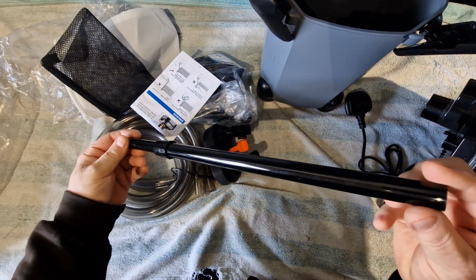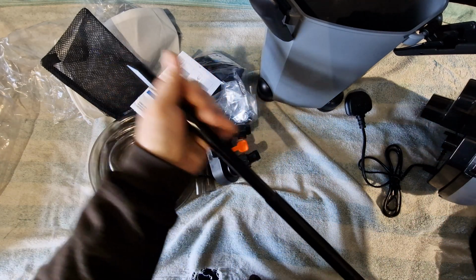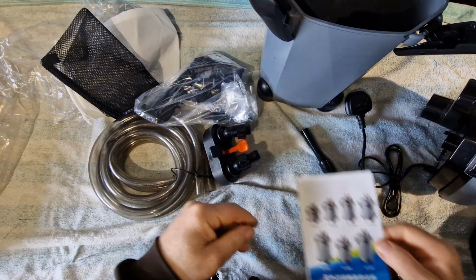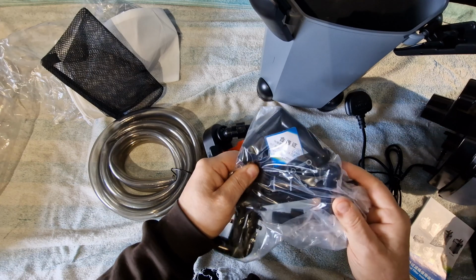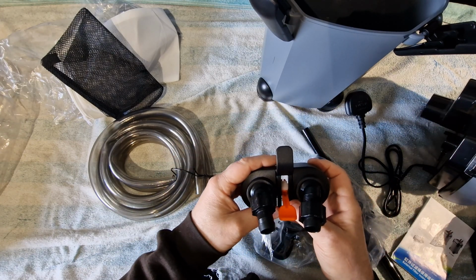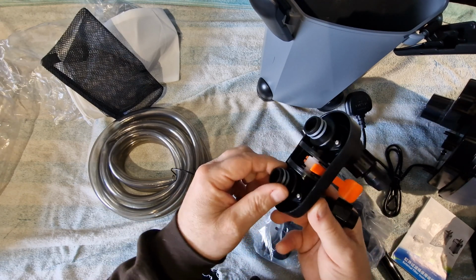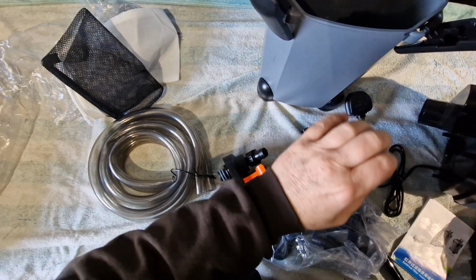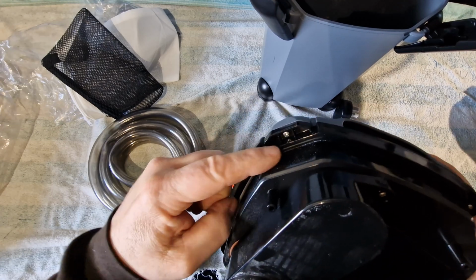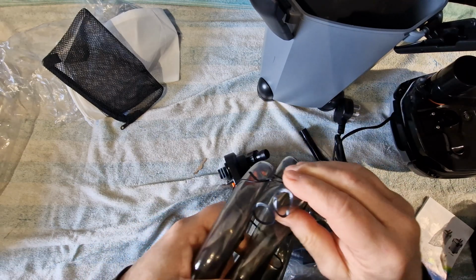Alright, so the pickup, 22mm. Okay, so this actually, oh, okay, that's quite cool. There's your range. That's the ones they do. That's all the pipes. And this is the stop valve. Always put a bit of grease around these guys. And there should be one. Yeah, see that? There's a very small gasket all the way around. Always put a little bit of grease around there, Vaseline, something like that.